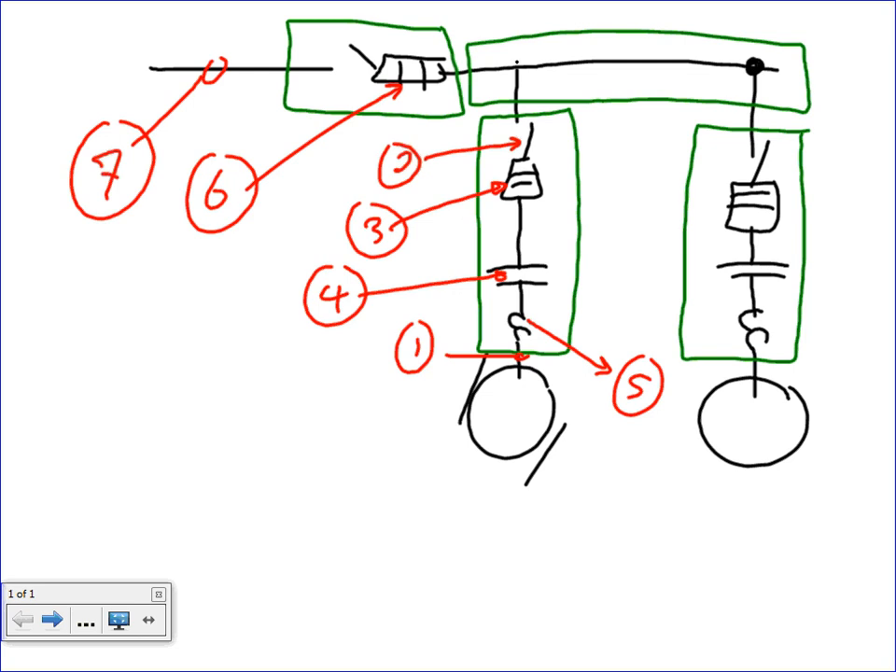These are taps. You guys know how to tap? You have lugs and you splice it — a tee. You tee these conductors, your feeders, and feed. You can feed as many as you want. This one is a gutter. This is a disconnect switch. And these are magnetic starters. Each one of them, and the bottom one of course is the motor.